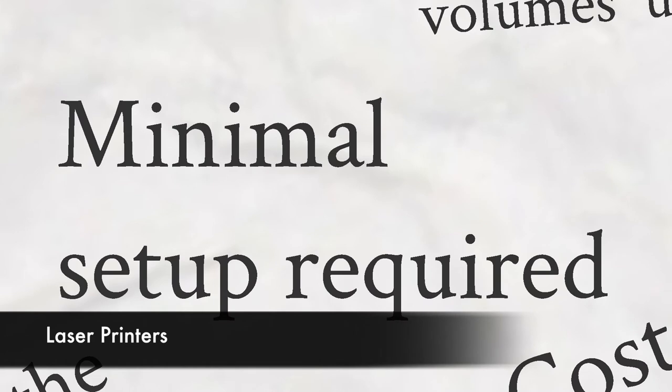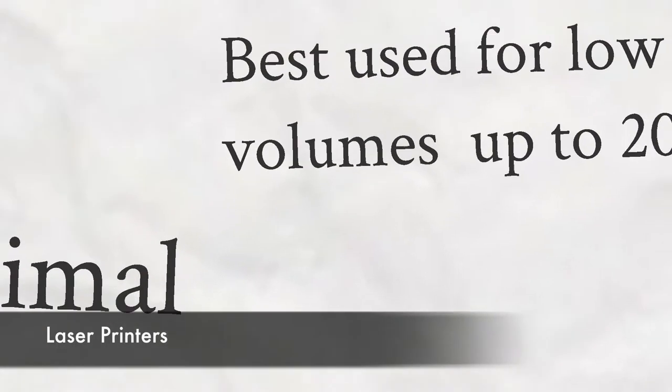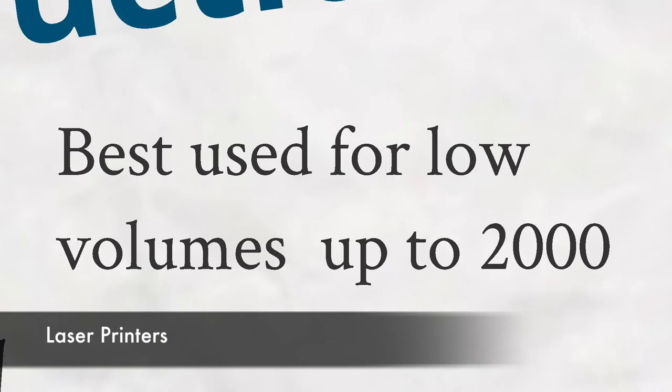The cost is driven by the actual device. Setup is minimal — almost no setup is required. You basically hit the button and it comes out of the laser. There's no setup cost — you just hit the button and it comes out. But it is slow, and it's best used for low volumes under 2,000. There are high-volume laser printers that run almost at the speed of small printing presses, but under a volume of 2,000 you could probably get away with using a laser and it might be cost effective.